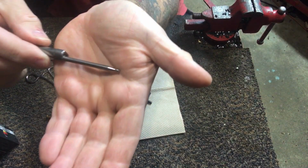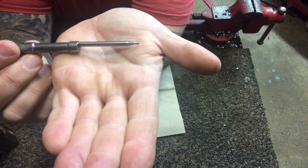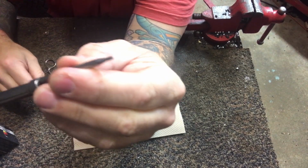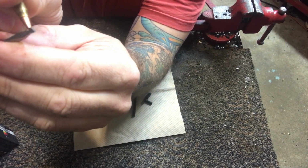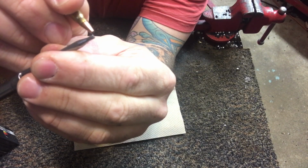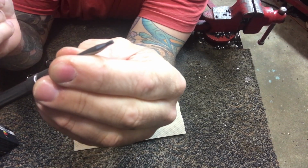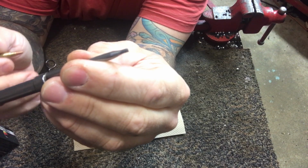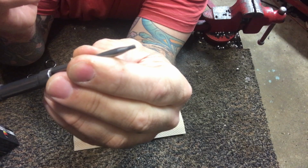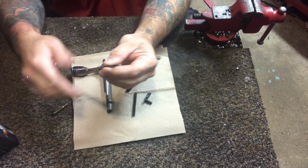But anyway, you'll see here you have this chisel point on this firing pin, and so the firing pin basically rides like this in the bolt, and it impacts like that. And so our goal, or my goal, is this little tip at the end, we're going to be slightly scalloping that to reduce the impact on the rim, to push it farther inside the case. So when the firing pin impacts, it only impacts inside the portion of the rim that does not have any priming compound.